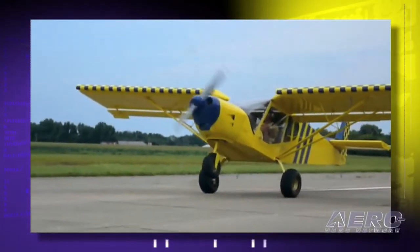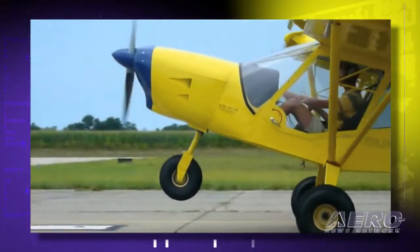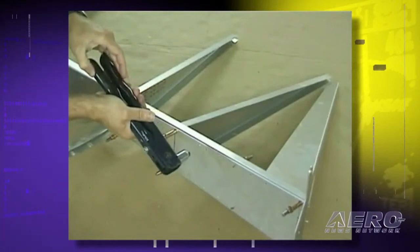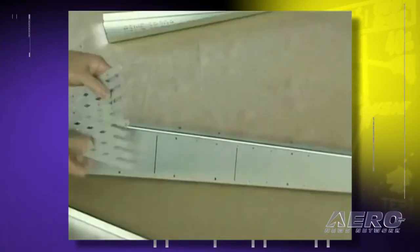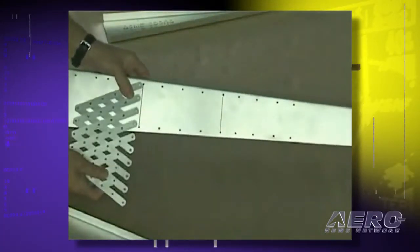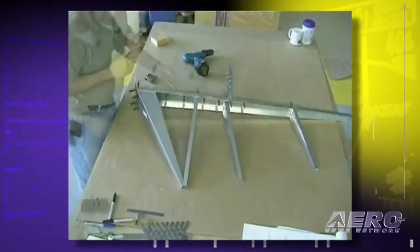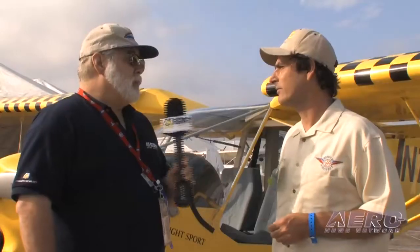Tell us about the kit construction requirements — times, tools, and so forth. Our philosophy in developing the kit is that we do anything that requires any special skills or tools here at the factory. So really, a minimum of tools. All the riveting uses blind pop-type rivets, so it's a simple hand tool for that. All the drilling and lining up, most of it has been done already, so a builder really just re-drills the holes, clicks things together, and does the final riveting. Basically a flat workbench table is all you need. We're seeing about 350 to 400 hours as a realistic build time — pretty good for a two-place STOL airplane. Most folks can do that in their single-car garage with basic hand tools.